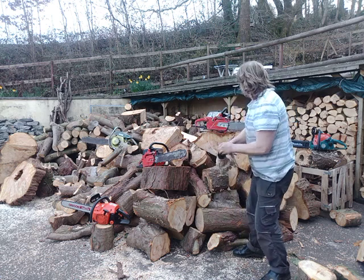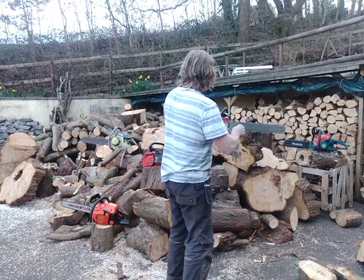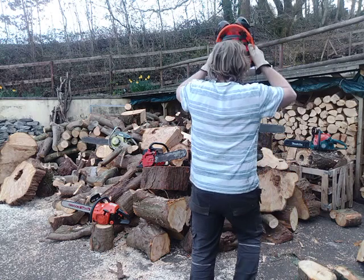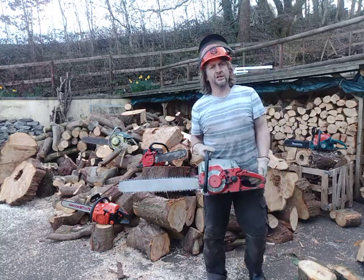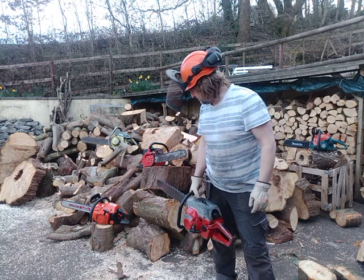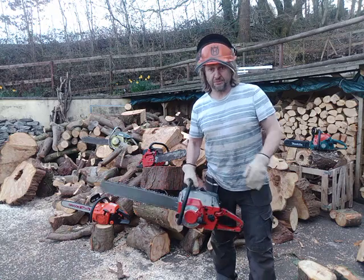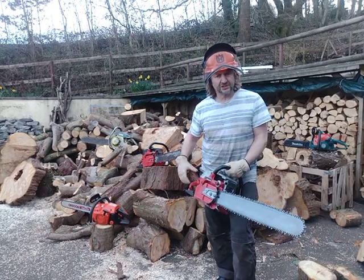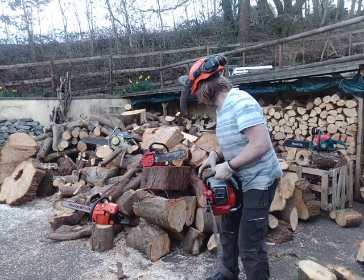Okay. So this girl hasn't been cut with for a while and it's a spectacular running engine. She can run up to a 31 inch bar on paper, although they state less on the 801, which is a little bit strange because they're the same internals as far as I'm aware. But I have one of these with a 32 inch bar and she pulls it. Power wise, they make, I think, between 3.5 and 3.6 kilowatts, so they're not far shy of a genuine 5 horsepower. Kill switch.